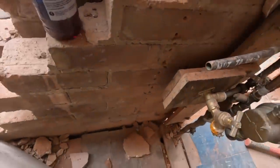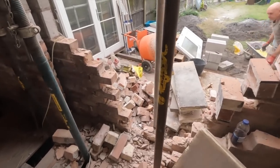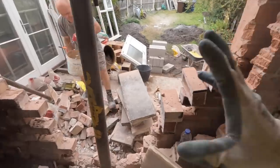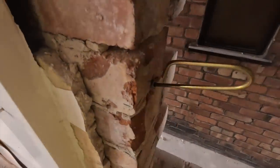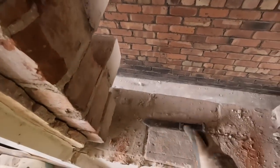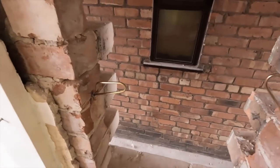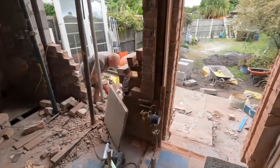I finished off the stitch drilling on both sides from the back, so the back can be fully emptied out. The front is going to get steeled, so that's that. And I have got this completely ready now, with the screw ties in. I'm going to try and put the tie wires in at an angle just so they don't stick out, and we can still bond some of this together, put some strength back into it. Dad's loaded some blocks in, and the trestles are down as you can see, so piece by piece.